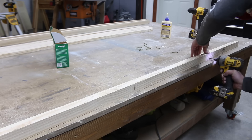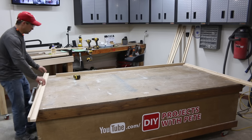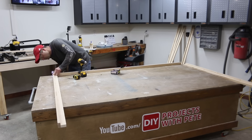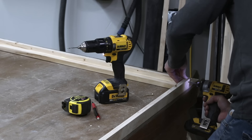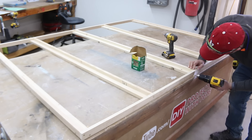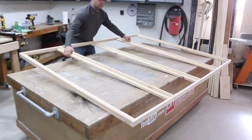If you're building a different size Murphy bed according to the Create-A-Bed plans, your dimensions will vary; however, the overall process will be very similar. Place the outside perimeter pieces of the wood bed frame on a flat surface. Drill two pilot holes through the frame side and into the strut. Add some wood glue at each connection and then attach using two-inch long number-eight screws — one screw will go into the vertical portion of the strut and the other into the horizontal part. The remaining struts will be spaced evenly and connected in the same fashion. All these boards are one-by-two boards, which is their nominal dimension, but their actual size is one-and-a-half inches wide by three-quarter inches thick.